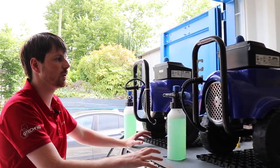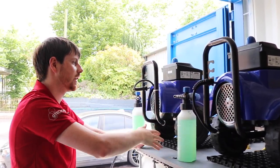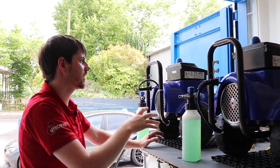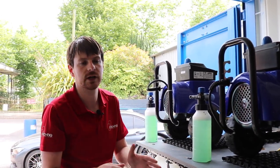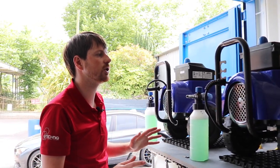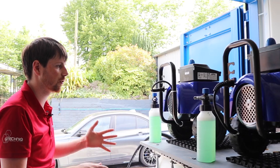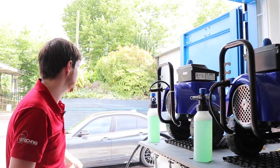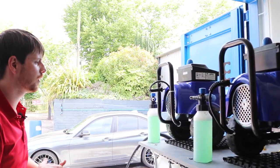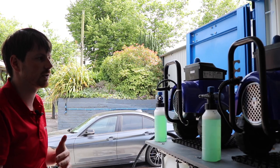Normally in the old days running a system like this would mean four hoses - two off each washer, one for foaming and one for rinsing - which causes an issue because you can't have both operating at once due to pressure drops. With this quick release way, there's no fear of pressure dropping or any pulsing of the machine, because you're only using one hose. That's less chance of bursting and fewer issues overall. One hose, one trigger, one rinse lance, one snow foam lance - just multiply that by two.